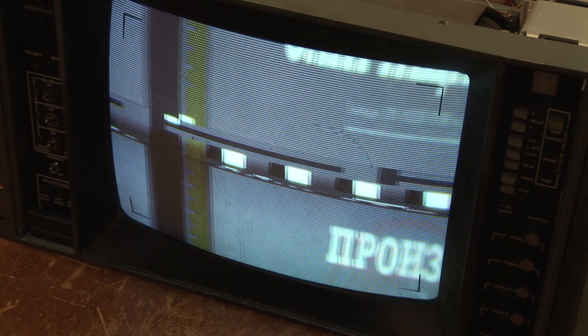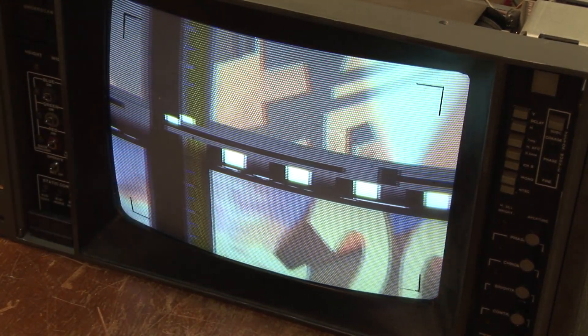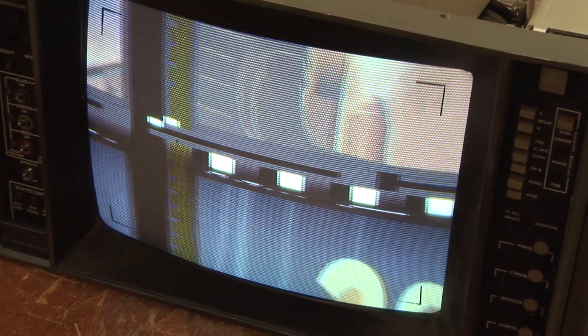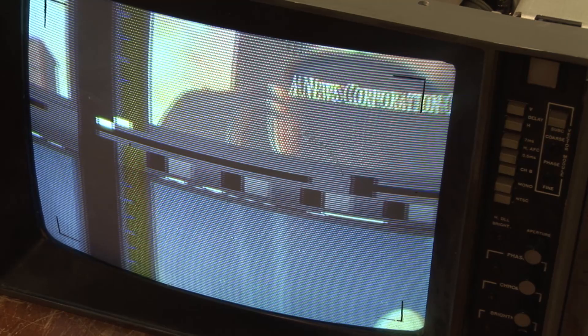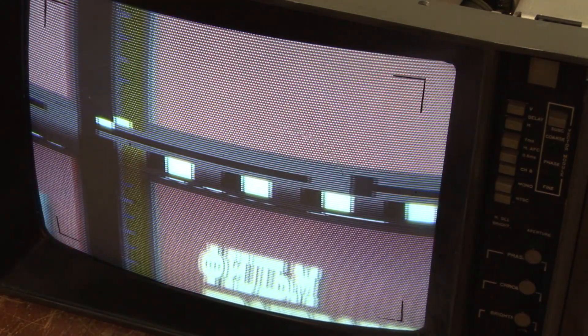What we're looking at here is a DVD — the movie is just starting — and here we see what they do on DVD, which is completely different than analog video. Here are our color stripe interference signals — you can see them come on and go off. This is what causes, when you try to make a copy of a DVD, those thin lines across the screen. We've also got our index signal here and our white and black pulses, which are actually driving my tube into overdrive and causing some flare because I've got the brightness cranked up.